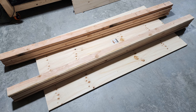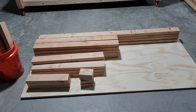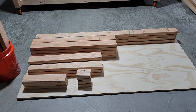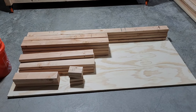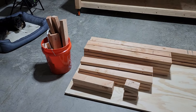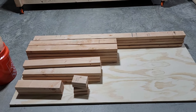I'm going to turn this pile of wood into this table that you see right here. To do this I purchased eight two-by-four-by-eights and a three-quarter inch four-by-eight piece of plywood that I then had ripped down to three foot by six foot, saving the one-foot-by-six-foot section so that I can have a wing that folds down and up whenever I need extra outfeed space. I saw a lady on YouTube make this table and I'll put her video's link in there because she probably deserves more credit.